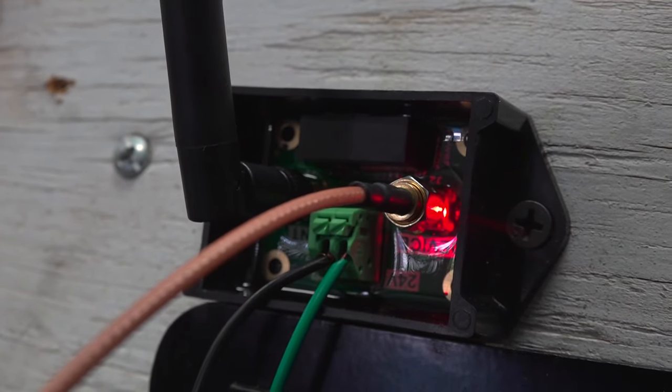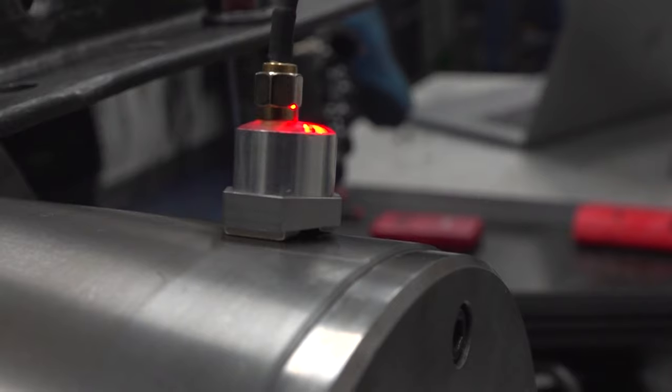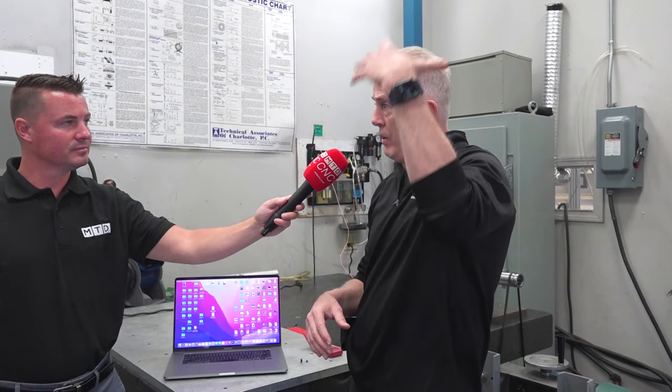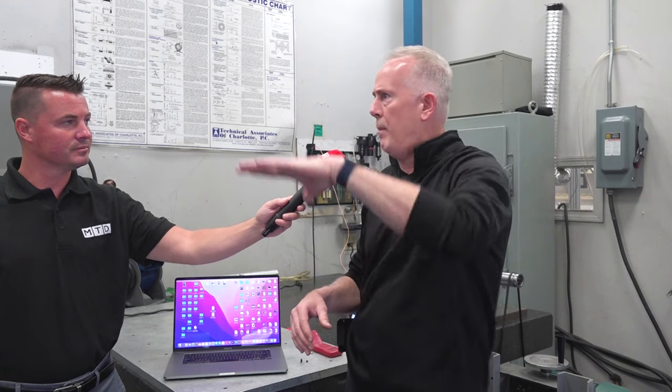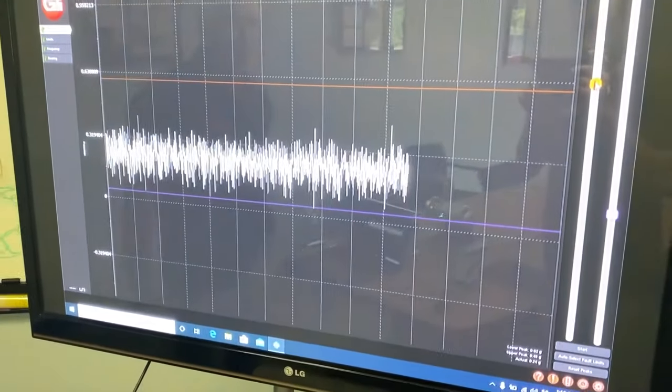What we've devised with Vibe Protect — you can see we've got a little receiver on the wall and a very tiny sensor that can actually be embedded into the spindle if we want to, but it also can be magnetically put on the spindle. What that allows us to do is the PLC will then turn that sensor on, and a receiver in the building can measure up to probably more than 50 different machines. Once that sensor is turned on by the PLC in a warm-up cycle where we are at a known speed, a known tool, and a known condition, we can take a measurement five times a day, once a week — whatever we please — and we're going to get a clean mechanical trend of the health of that spindle. Whether we have an imbalance issue, misalignment, or impending bearing failure, we're going to have permanent mount ability on a machine tool spindle.